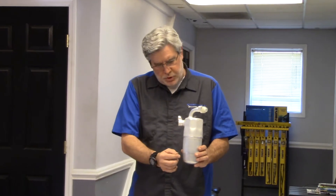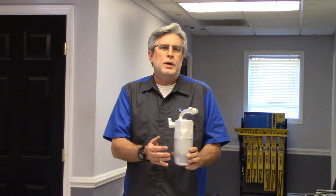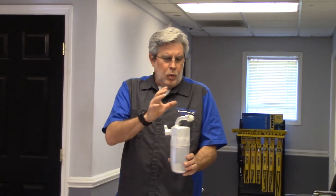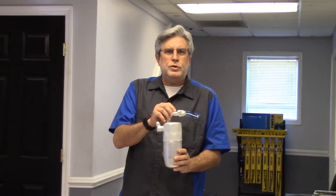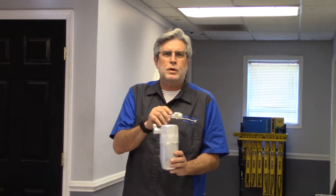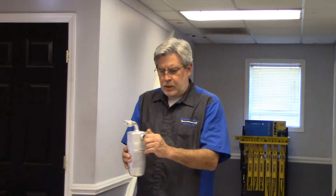The bottom of the tube is a small screen with a little small hole in it that allows the refrigerant to pick up and absorb some of the oil that migrates into the accumulator tank. One of the primary functions of the accumulator tank is to keep liquid refrigerant from going into the suction side of the compressor. We do not want to compress liquid inside an air conditioning compressor — it will destroy the compressor.